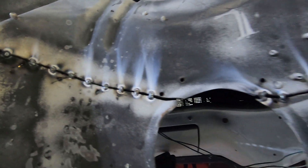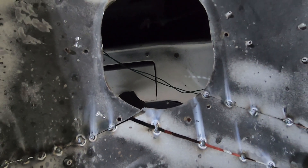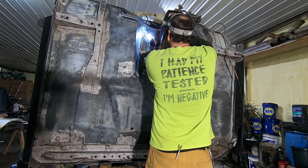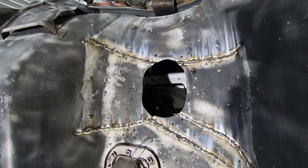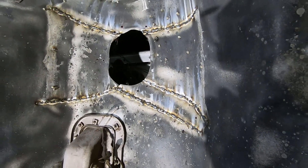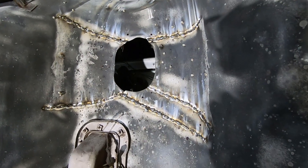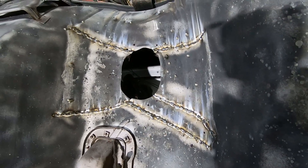That's pretty good. Some of it's not lined up exactly perfect, like right here, but you know, a hack job like that — what are you going to do? Fully welded. I don't really care what that looks like; it's kind of standard practice. I wanted to do the majority of the welding on this side. I'm just gonna take a wire brush to that and clean all the stuff off it so the paint will stick.